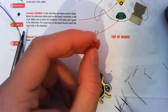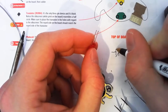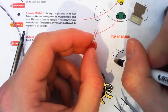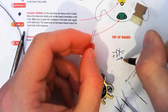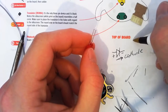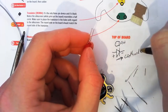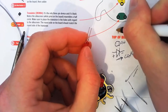On our little diagram of our LED, we've got our diode. Sorry about my drawing, I'm trying to draw looking at a screen here. Plus I suck at drawing to start with. So we've got a diode. Now we've got our negative side here, our positive side here. So we can flow through this way, but we can't go the other way. So this negative side is our cathode, which on our LED, if we draw our LED, it's going to look like this from a top view. So our flat side is our cathode, which is our negative. Our other side has a long leg.